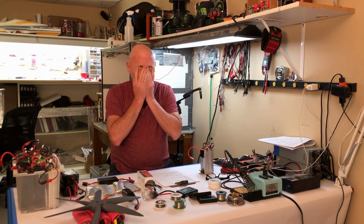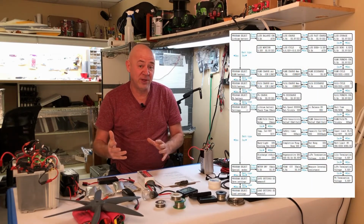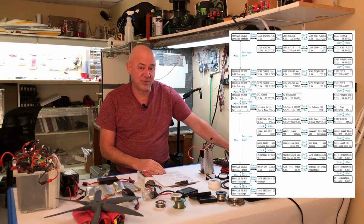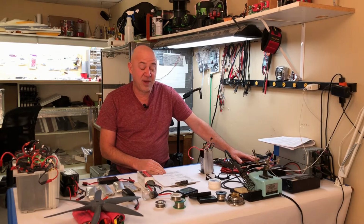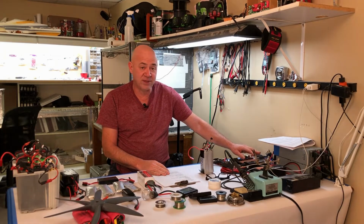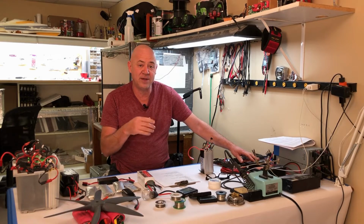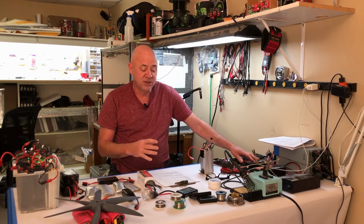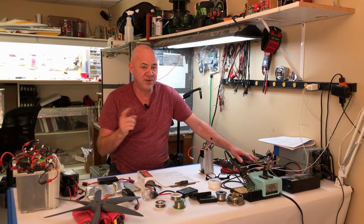Well, read your manuals and see what your charger is capable of doing. Because my iChargers, my 3010Bs, they actually have some cool things they do that have nothing to do with charging batteries. One of them is that if you have a brushed motor, the 2-wire motor brushed, and you want to break it in, it's got a motor setting for breaking in motors. Also, another cool thing is it can become a power supply for a hot wire, for doing hot wire cutting styrofoam like wings and fuselages. So just read your manual. Your charger is probably capable of doing a little bit more than you know until you read the manual.